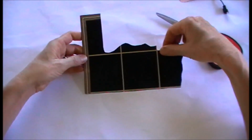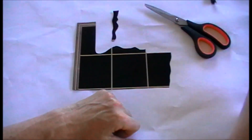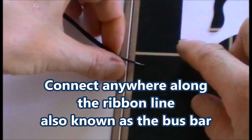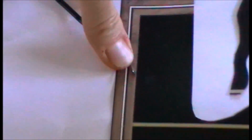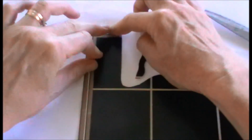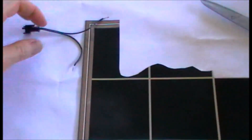One important rule when cutting is to not do it the way I just did, because my piece has only got one little line to connect to — it's absolutely no good. You need two lines. Anywhere along here you can connect up the power source. Here is a black lock connector, similar to the one you would use for EL wires. It's a split AC current that enters through this wire from the inverter, so it gets split as it comes out. You have to put one wire on each bus bar. It doesn't matter where on the bus bar you put it, just as long as there's one on each and that the current doesn't jump across that white strip.